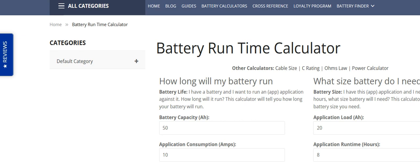Keep in mind: the Retevis RT97 repeater, according to the specs, draws about 5.5 amps at full power. And if you want to run an amplifier with it — I'm going to be doing that — the Retevis RT91 amplifier also draws up to about five amps under full power. So that's 10.5 amps minimum that I would be drawing just using the repeater and the amplifier together. You'd want to go a little higher than that — maybe put in 15 amps so you have a little leeway.